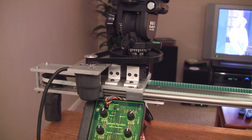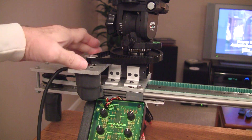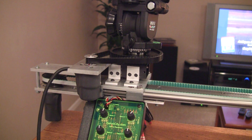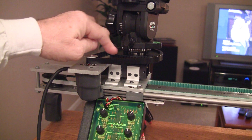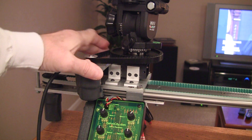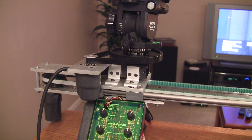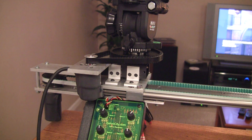This is the update I've made to my Igus slider. This box down here — I didn't have before — was the device from Servo City. It had a servo mounted in it with a little brass gear that drove a big aluminum gear up here. The problem with all the servo-driven devices from Servo City was that the resolution and smoothness at very low speeds was just not good enough. If you're panning with something zoomed in, you want it to be very smooth and very slow.